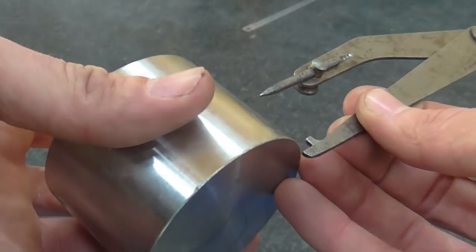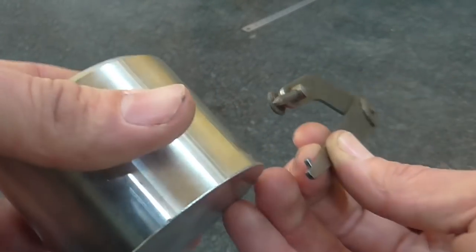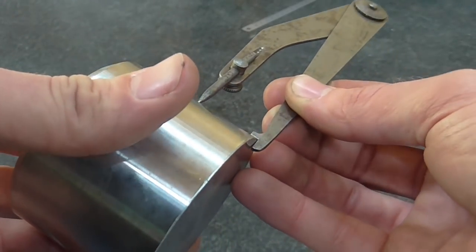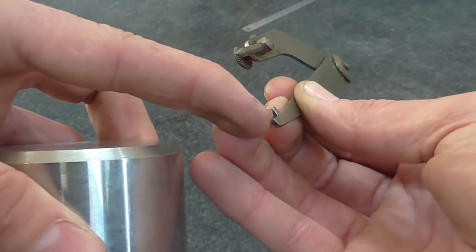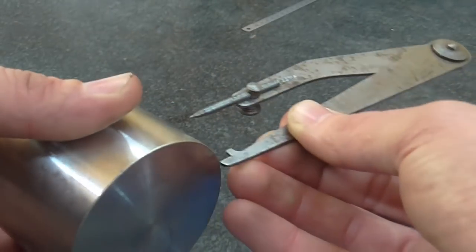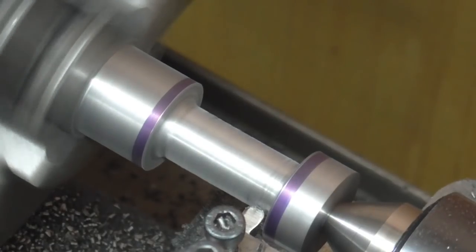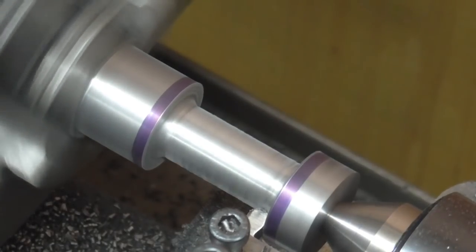Something that may not have been clear: when working with spinning components, I bring the corner of the notch in to touch the corner of the component at a slight angle — that stops this portion of the caliper scratching the finished face.